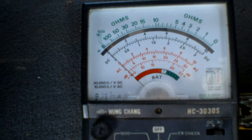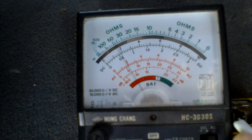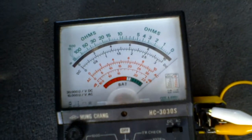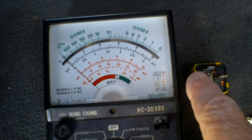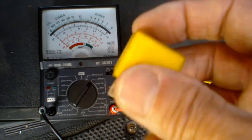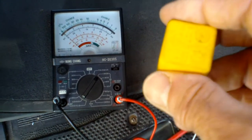We've got no connection on that one, which suggests to me it's the load side. Going on to the next one - we know we didn't have a connection on that one - but oh, we've got a connection there! Full deflection on that one, and on this one here we've got nothing at all. So we now know that the connection for the coil which energizes the relay is on these two pins here. The actual relay load - the wire in and wire out - goes to these two here. Now we know this relay is fine and working.